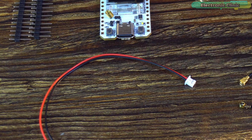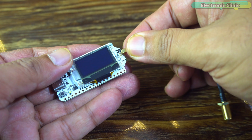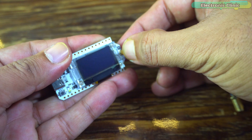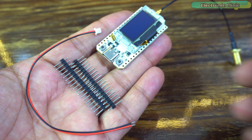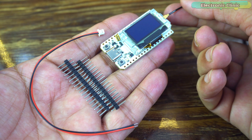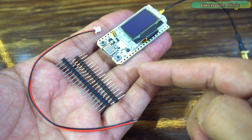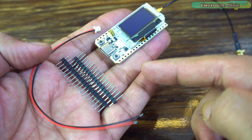There is also a small cable for connecting a LiPo battery. For now, I will keep things very simple — no soldering yet, no battery. I will power the board directly from my laptop or a 5-volt adapter and start with some initial tests. If you plan to use these boards for automation, I definitely recommend soldering the headers because you will need reliable connections for sensors and input-output pins.